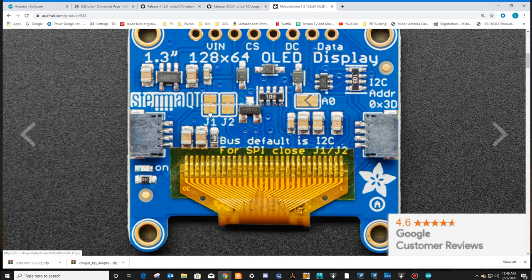It's a little deceiving. I wasted a board because I couldn't get it to work. I soldered between these two, and I soldered between these two, and it never did work. It didn't matter what kind of solder removal tool or wick I had, I couldn't get the solder out between the two. It was ruined. I had to buy another one.